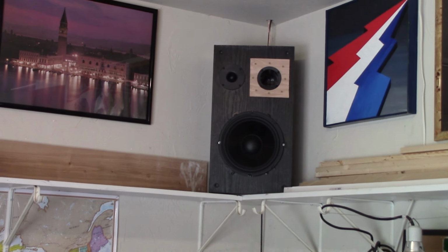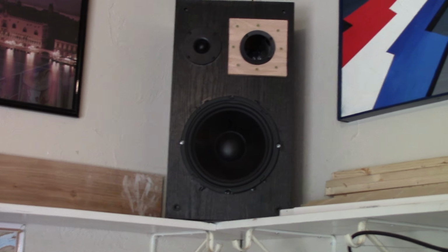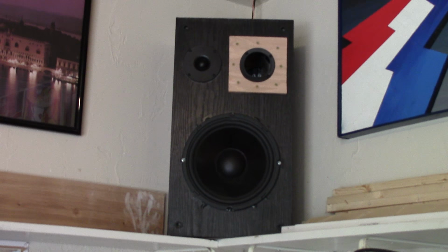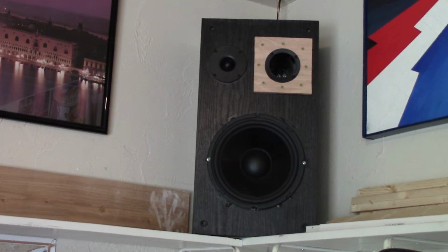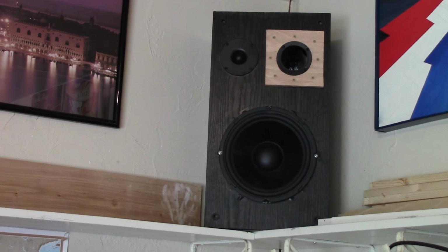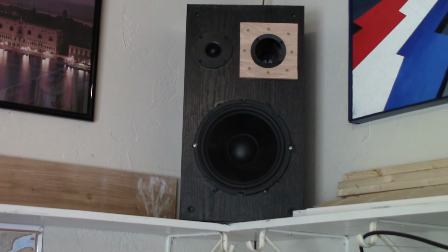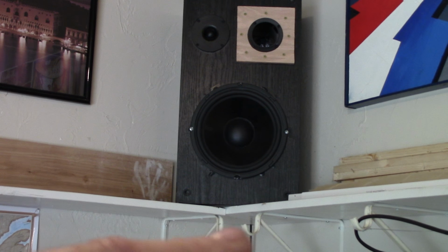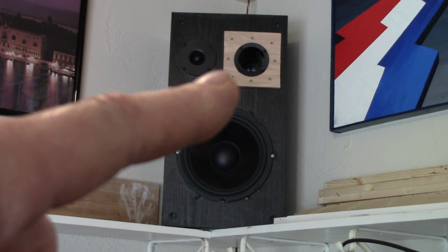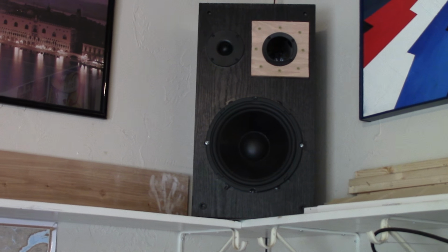And this morning also worked on this speaker up here. These are my pawn shop throw-togethers, I guess is what you call them. I put the 10-inch Dayton Audio Classic woofer in there, and gosh, I think that's a Morel driver or Goldwood. I can't remember which one it is, but it was originally a three-way speaker, and I had the bass, I don't know what you call that, port thing on the back side, and I covered that up, and I took the mid-range out because it sounded like crap, and put the port in the front so the bass comes out, everything comes out the front.